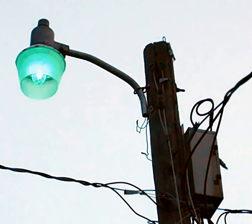The mercury in the tube is a liquid at normal temperatures. It needs to be vaporized and ionized before the lamp can produce its full light output. To facilitate starting of the lamp, a third electrode is mounted near one of the main electrodes and connected through a resistor to the other main electrode. In addition to the mercury, the tube is filled with argon gas at low pressure. When power is applied, if there is sufficient voltage to ionize it, the ionized argon gas will strike a small arc between the starting electrode and the adjacent main electrode. As the ionized argon conducts, the heat from its arc vaporizes the liquid mercury.